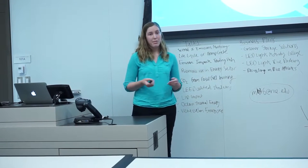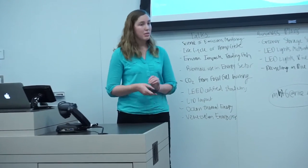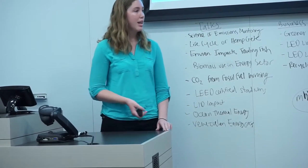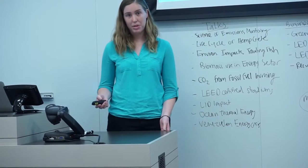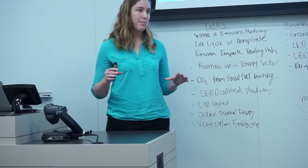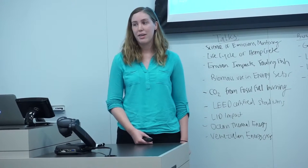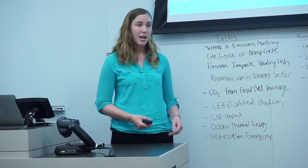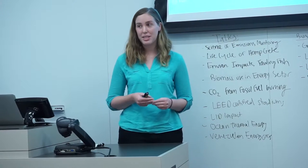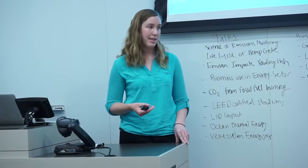Now at the end of life, what would happen? Hempcrete is actually very much recyclable — a hundred percent can be used in future buildings. Minimal labor would be required for demolishing a hempcrete building, and after crushing it up, you can leave it in place as it will absorb into the soil and work as a fertilizer. In fact, hempcrete has been sought out for soil contamination treatment because it can improve soils that have been contaminated with heavy metals.